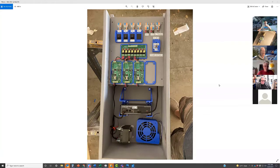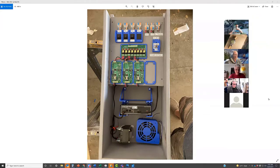So yeah, the second one is a cab ride oriented thing. We're building the DCC. The layout in Pleasanton, when they went to DCC, they wired DCC directly into the two original DC blocks, and the layout's almost 110 feet long. Each side has at least 9 main blocks and 5 or 6 other blocks. And of course they were wired with the wires being somewhat apart. If you understand what a dipole antenna is, each DCC circuit has like 4 to 10 50-foot dipole antennas on it. So the noise level was unbelievable.